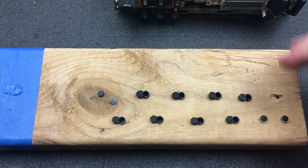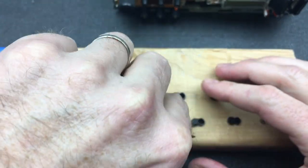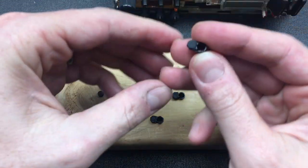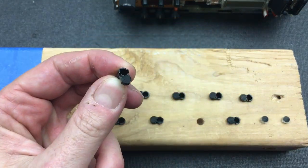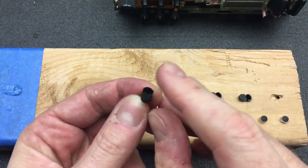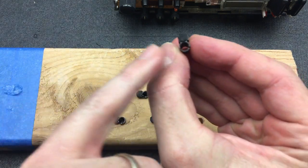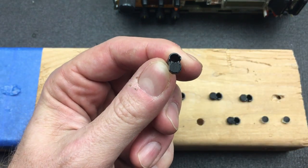What you'll see, if I take one of these out here very cautiously, is that whilst these will probably work mostly okay, there we go, you can see in front of the camera there's a slight concaveness to some of these items across the middle like this, and that's because the glue doesn't give any support. So when you put the pad on the top, the pad starts to curl a little bit, and you get that slight concave shape which you're seeing over here.